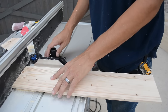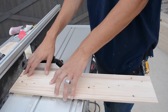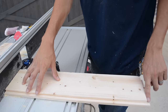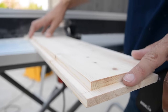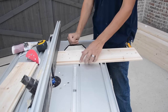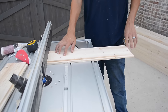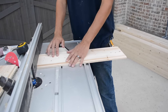You saw me pass through the bit using the miter gauge. Now, to help you not mess it up, just take the board and make it do a flip towards you. You can see I have this lap joint cut out now on the long side of the board and on the end grain. I want that same cut out on the end grain but on the opposite side, so when these boards come together it'll be similar to hardwood flooring where they join and link in every direction. After the flip, the easiest way to think of it: you should see the cut-out part facing up at you. If you can't see it, you're wrong — make sure you can see what you cut, then run this one through.